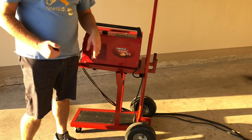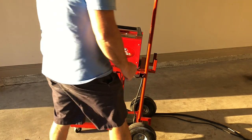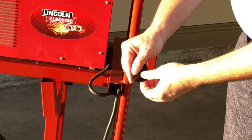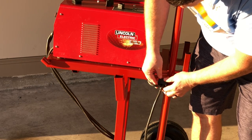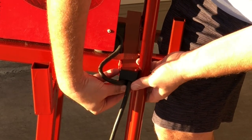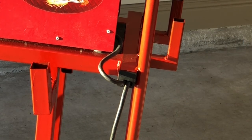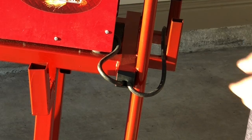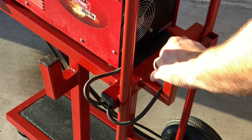I want to go over a few finishing touches. The Lincoln Electric welder is actually attached to the cart — it does not come off. I opened up where the wire feed goes and ran bolts through holes down through the plastic lumber and bolted it down. I've taken a one-and-a-half-inch end cap, drilled a couple of holes in it, cut a hole in the corner, and I'm running the wires through there for a nice finished look. I've got the cables ran through the tubing and now I'm putting the cap in — so I'll only have about a foot of wire sticking out. I'll hook the extension cord onto that, and it'll stay plugged in. I'll also get an extension cord with three ends so I can run the grinder and charge a phone or camera.